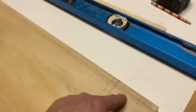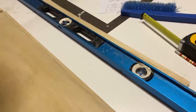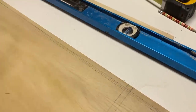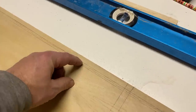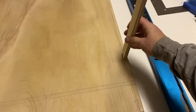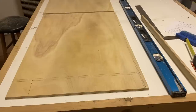And then the same thing along the back. I'm going to have a 1/4 inch piece of panel that goes in the back, and I want that to slide right into the end of this. It's also going to fit down into a notch in the floor, so it'll have a little groove that the backing sits into. I've left that 1/2 inch away from the back because in the end, I'm going to use some of my 1/2 inch plywood to connect the two sides together to sturdy everything up. So let's get to work.